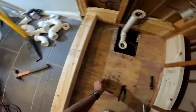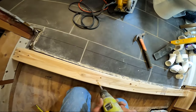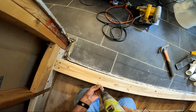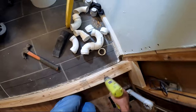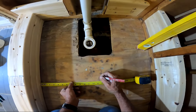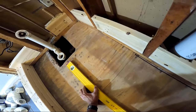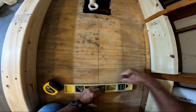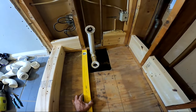Now that the curb is set, I can figure out the math on my drain. The drain is inch-and-a-half because it was a tub — being converted to a shower, the pipe transition should go as far back up under the subfloor as possible. I'm centering exactly where my drain will land, both left-to-right and front-to-back, and drawing out a line because I'll need to cut out that swath of plywood. I'm also figuring out the cross-section of where the flange is going to anchor to the floor.